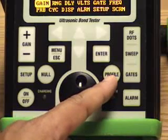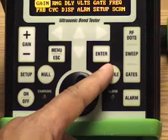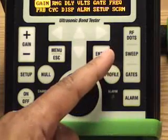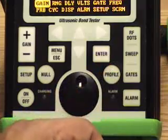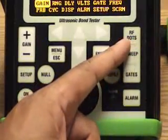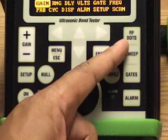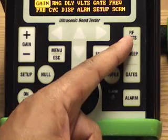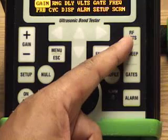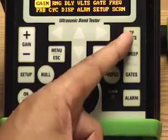In Profile mode we have the peak amplitude profile or scan, the phase profile or scan, and the signature mode. The RF dot button will allow you to toggle between the RF waveform used on Pitch Catch and Mia, to the impedance plane dot display that can be used in Resonance, Mia, and Pitch Catch.